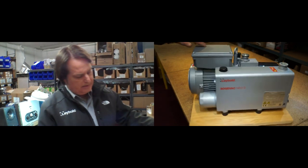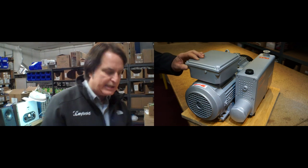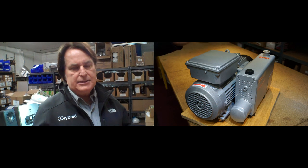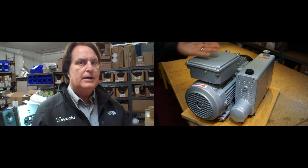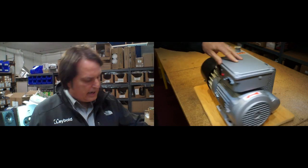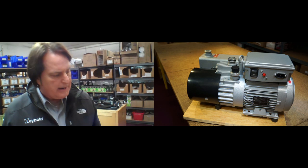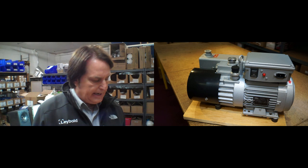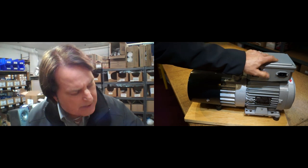When we turn around the pump, we see a nice automotive-style paper filter. It's not there to neutralize the oil or do anything fancy — just like in your car, it's there to trap any large particulates or sludge that might block up the oil lubrication circuits in the pump. On the motor, it's rated at 115V, 60 hertz — basically a motor developed for North America. It has a built-in on/off and a breaker.